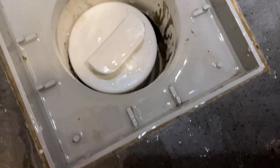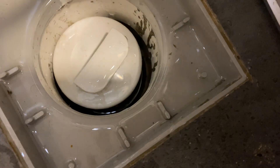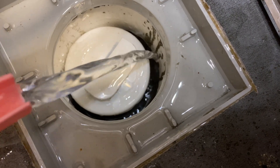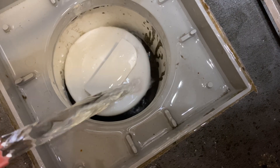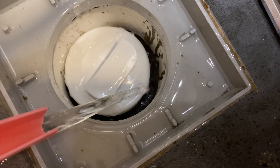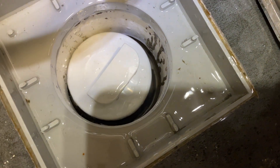This is actually a floor trap insert. The main intention was designed to prevent odor from coming out. I'm pouring water into it to test if there's a leakage. The water level is so low and it takes so long to fill — definitely there is a leakage in this floor trap.